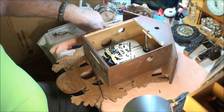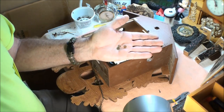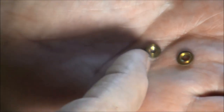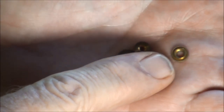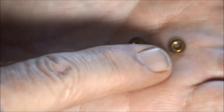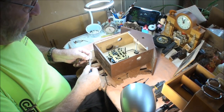Let me show you these hands — to me these are what I call the old school ones. What normally goes on is this nut with a square hole that drops straight on. It has a ridge around the square hole that's meant to get the minute hand centered so it doesn't move around. Then you have this washer here that sets on after the minute hand is put on, then you have this nut that squishes the washer down to hold it into place.